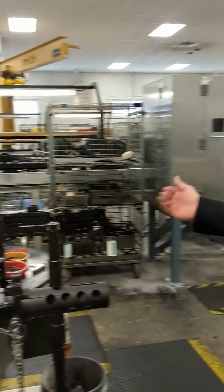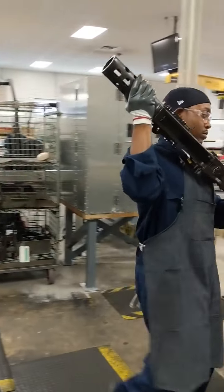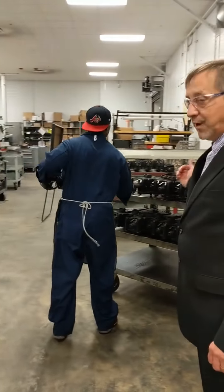I also want to note: we are the DOD's primary repair facility for small arms weapons. After the mechanic double-checks all the tolerances to make sure nothing has changed, he takes the weapon and places it onto the rack. From there, the weapons go to the indoor firing range where they go through a series of function fire tests. After the weapons are function fired, they go to the cleaning line — a conveyor system where they field strip all the weapons down, run it through a cleaning cycle, put a heavy coat of oil, then it goes through final inspection. Once it passes final inspection, it goes to shipping, then to DLA, and DLA distributes to the soldier in the field. Thank you, from Anniston Army Depot.